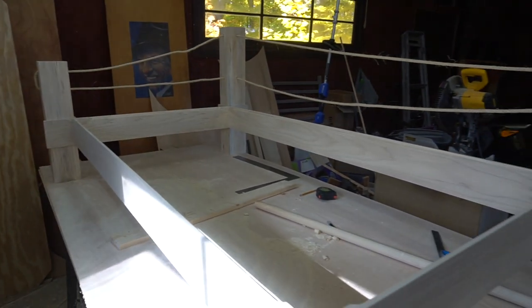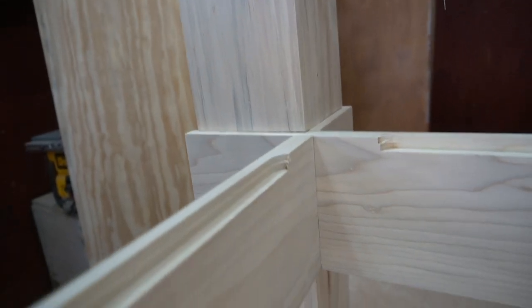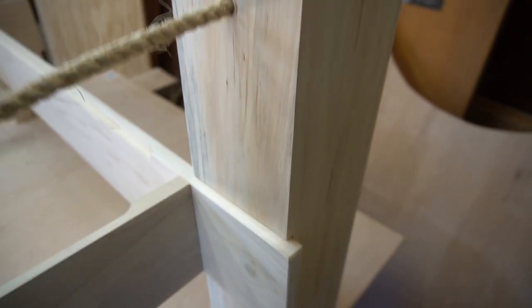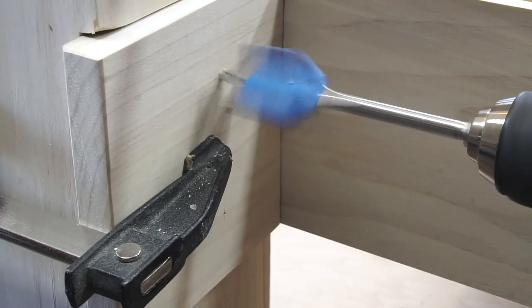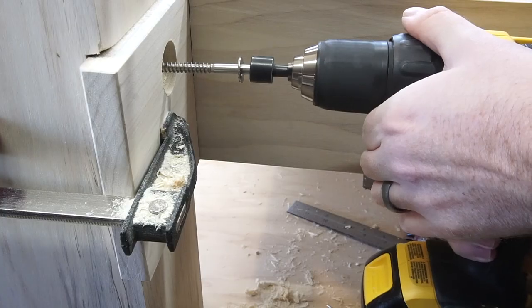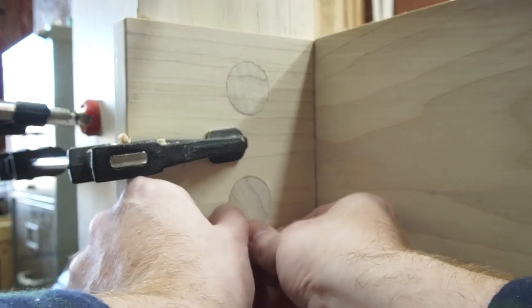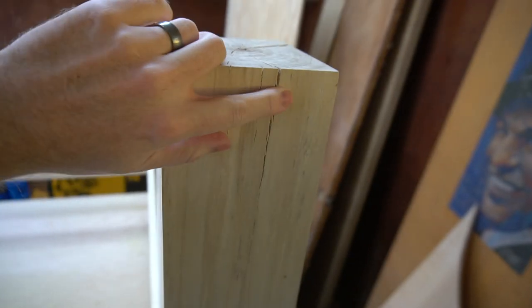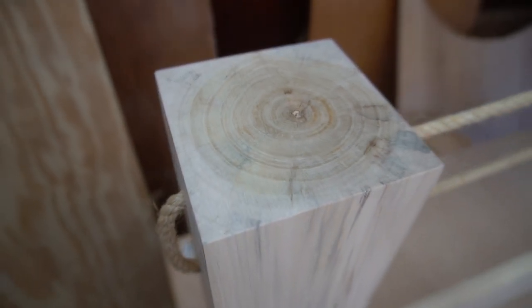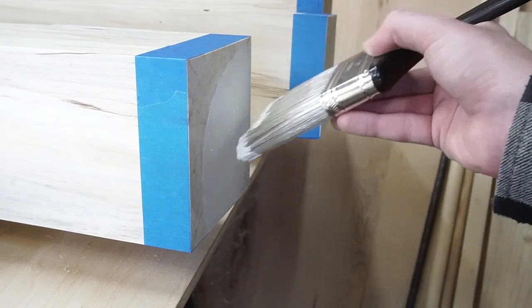Let's talk about shrinkage. I used an online calculator to figure out the shrinkage of this wood based on the species, moisture content, and size. This wood is about 18% moisture content and it told me it's going to shrink about 5/32 of an inch, or almost 4 millimeters. That makes me a little worried about this joint — if it shrinks that much it might damage it. So I'm going to wait a while before fully attaching it on both sides; first I'll just attach it on one side to allow the large post to shrink without damaging the joint. Some of these posts are also splitting and will continue to do so until the wood is dry. I'm going to finish the ends with anchor seal to prevent some of the splitting, but doing this kind of work with green wood, you just have to account for the cracking.